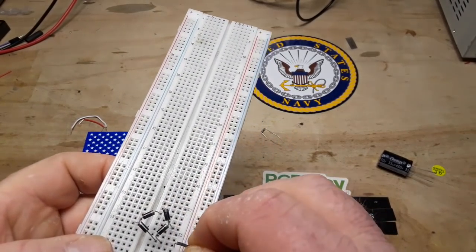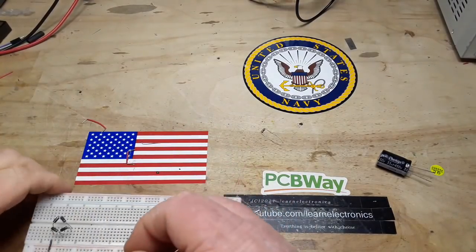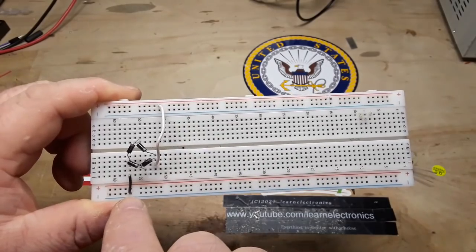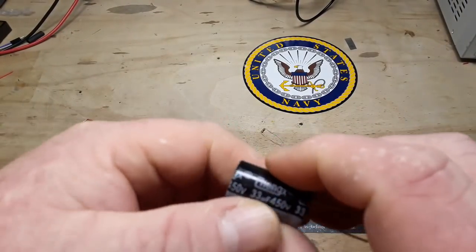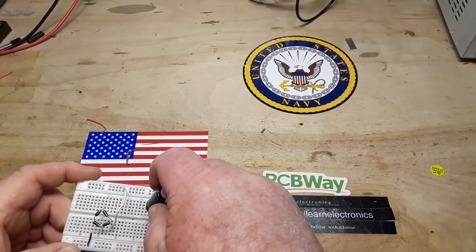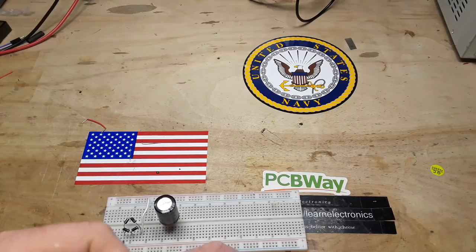This is our DC ground point here, and this is our DC positive output here. We've taken our positive up to the red rail and our negative, or ground, down to the blue rail. Next we'll put in a smoothing cap — this is 33 microfarad at 450 volts. It's big, but not going to hurt anything. We'll get that in there and attach it to the rails.